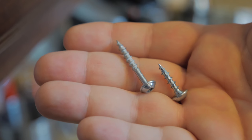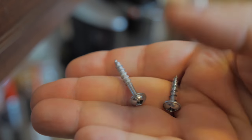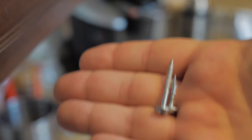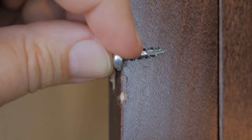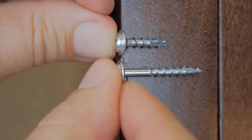The first way to fix this: if you take a look at the size of this screw, it's really short. My first recommendation is to use a longer screw — just screw it in and there'll be more wood deeper into the cabinet for the screw to hold on to.